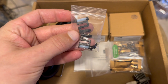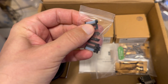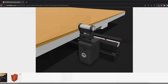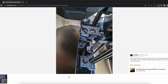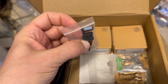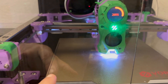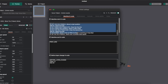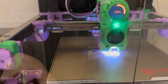Here are all the parts that came with the Bambu, and those rollers I was talking about. It looks like there's a PTFE tube or something like that, just put into a plastic piece. I'm printing a part in ABS that will go in the place of the Z-switch that used to be on my Voron Trident. We're going to remove it and place it over there. You can see on the left side I have added the purge line — this thing is saving a lot of time, you don't have to jump around and pick up the drops, it just goes there.